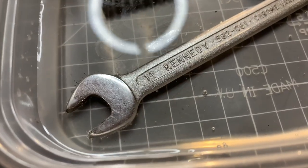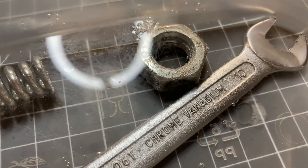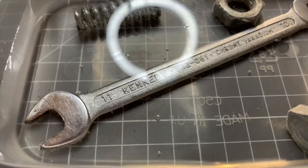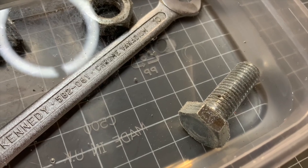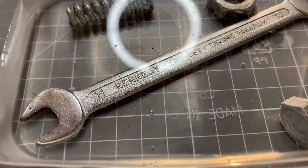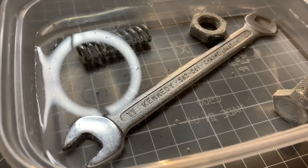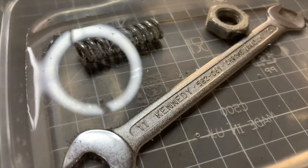I don't know if this is going to be very clear, but as you can see there are bubbles starting to form on the items — you can see on the nut there, the bubbles starting to come up. This is the acid eating away at the items and taking that zinc coating off. What is actually being produced here is hydrogen — hydrogen is highly flammable, however it's being produced in such small quantities that it's not really dangerous. But you do want to make sure you're doing this in a well-ventilated area and don't stand over it huffing the fumes.